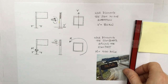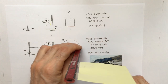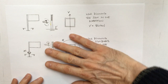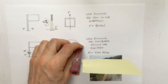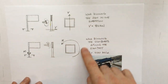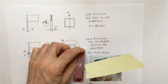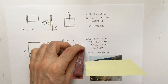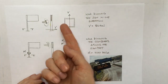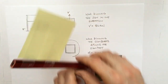Let's now think about some in-plane bending. There are going to be shear forces in the bolt group when the bolt plate twists around. When the wind blows onto the signboard it tends to twist the whole thing around, creating a bending moment in the plane of the plate, which creates shear force. Also, when the wind blows onto the entire structure it tends to push it all in one direction, creating a direct shear as well. So the same wind is doing both things at once.